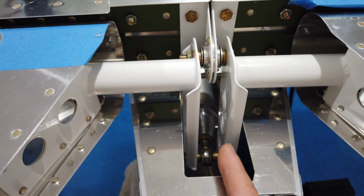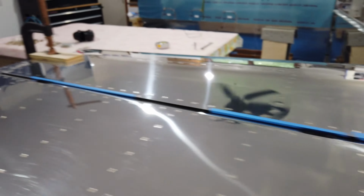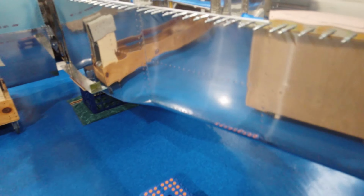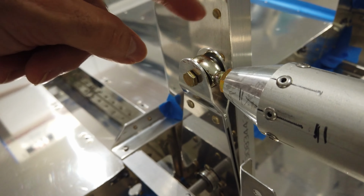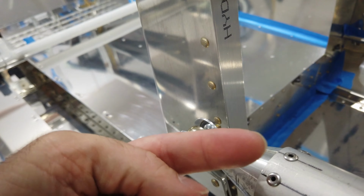Then without moving this, without allowing it to swivel so that it's locked up against one or the other horn, you do the same thing with the front swivel. You want to set that jam nut with the ball end perpendicular. You don't want your ball end here to be swiveled up against, potentially up against your bell crank. It doesn't actually hit, but what I'm saying is you don't want this to be preloaded one way or the other like this. And then the other end the same way.